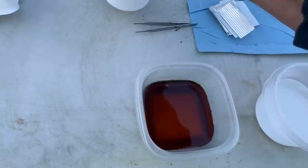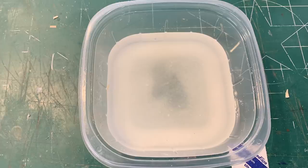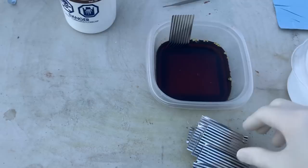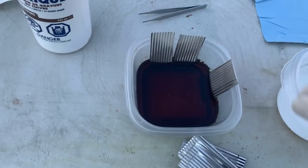This stuff is very caustic — this is ferric chloride. We got this on Amazon as well; it has to be ground shipped because it's very toxic. But this is what etches the aluminum panels. I also mixed up a batch of soda water using baking soda, because as soon as you put the panels in the soda it immediately stops the reaction of the acid, and at the same time it adds a certain color to it. Sometimes I'll go straight from the acid into water, sometimes straight into the soda — usually into the soda.